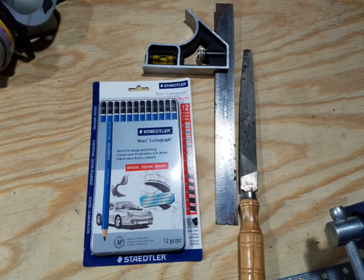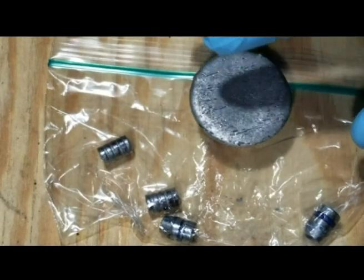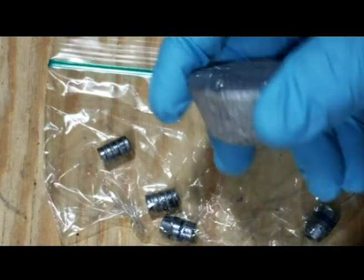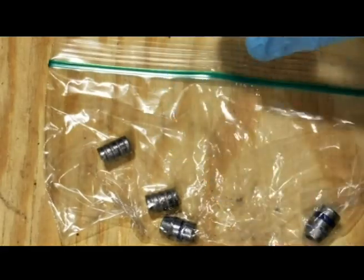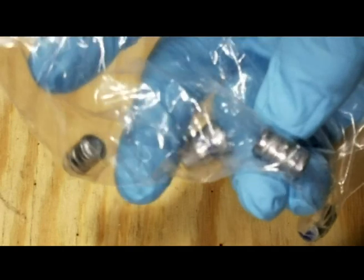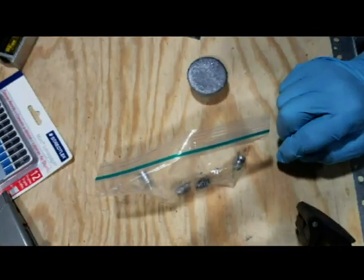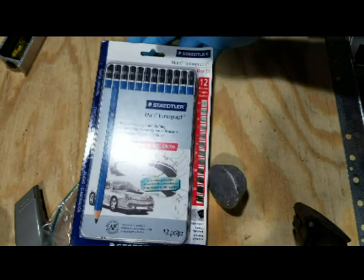Let's get into how to test the lead. Basically you take a pencil and make a 90-degree edge in the lead. I've got the puck here and I've got different cast bullets I've cast in the past but I kind of forgot what hardness they were. I'm going to be doing some powder coating and want to see how hard I can push these. I believe these are quenched number two Lyman, but when I file them down we're going to lose the quenching hardness.